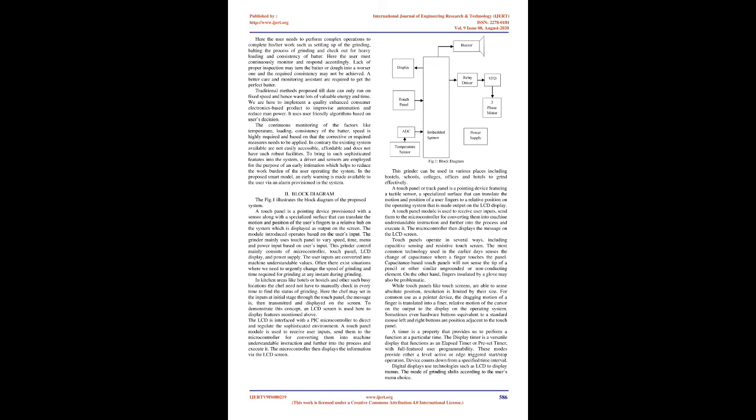6. Minglesia et al. proposed a concept on special characteristics of grinding, including a selection of inspection parameters, a model of the grinding feed system, and the design of the controller. Results of detailed analysis reveal that the system can ensure a stable grinding force and enhance the machining quality. 7. Sekram et al. proposed a concept on the design and development of a high-efficiency 3-phase, 6/4 switched reluctance motor, SRM, for driving a 280W mixer grinder. The conventional motor under usage for this purpose up till now is a complex one, and because of its limitations like the requirement of a commutator with brushes, and absence of easy controllability, the efficiency never exceeds 70%.